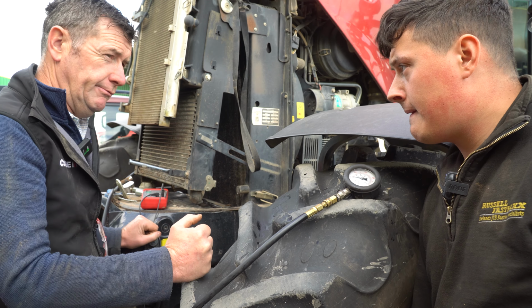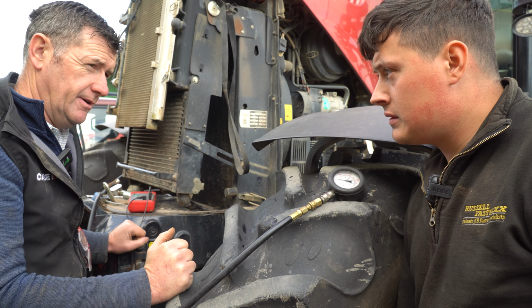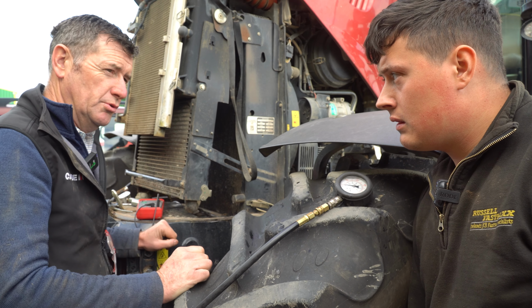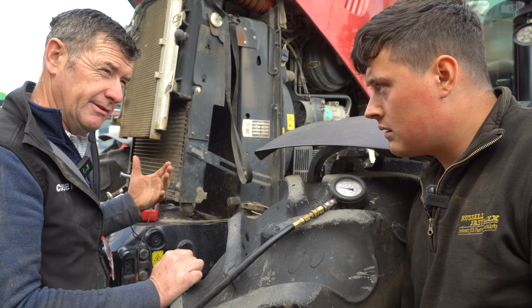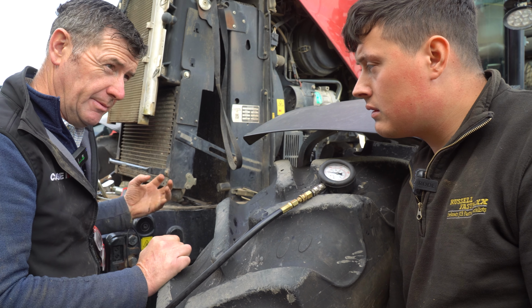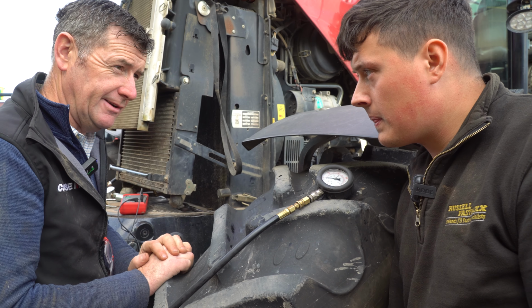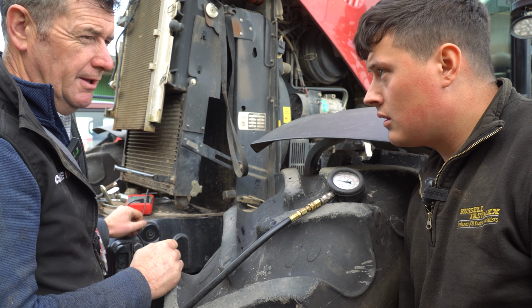It did drive it when we put it on that time when we thought we had it fixed. It did drive the chopper for maybe 5 minutes, I'd say, and then we had a no-show after that. I just turned it off, but I wasn't sure. I could hear a jingling noise coming out of it, like with the plates, so I wasn't sure whether there was a problem with the friction plates or not. Which could still be the case, but the fact that we probably never used it before would suggest possibly not.